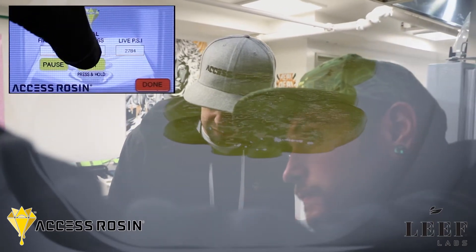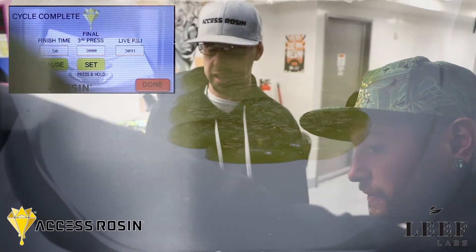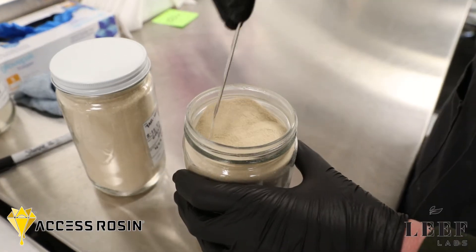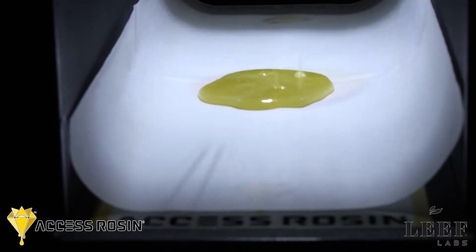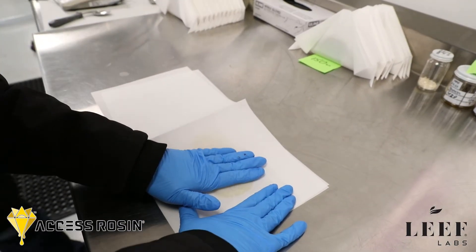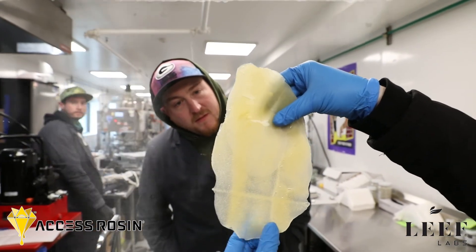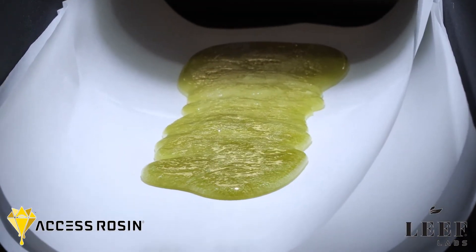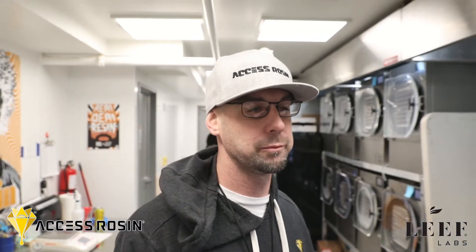I feel like you're getting a lot better shade of light yellow. I just want to try to tune one recipe real quick and see that it's working a lot better. Mission complete — that was it. Just got done with the service tech doing a full calibration, a recalibration of the pump, and also the press itself, trying to identify why the pressure was minimally overthrowing the original set point pressure. There had to be a fine-tuned calibration reset on the sensor itself for the PLC.